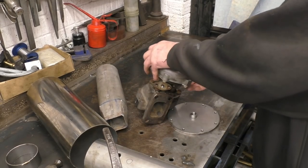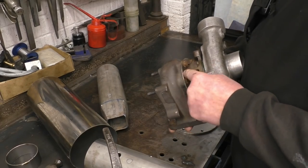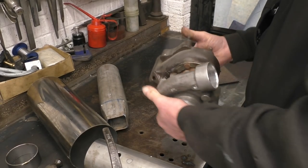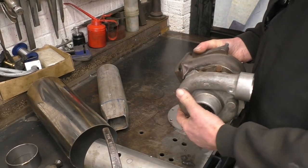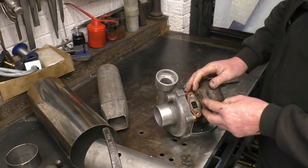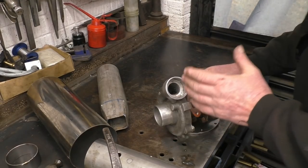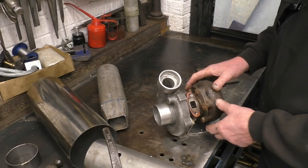The inlet side of the turbo can go anywhere - the exhaust side is fastened to where the studs are actually drilled and tapped. But I want to move it; I want the oil drain at the bottom and I want the combustor can to go in there. So I'm going to try and get these bolts out and see if I can turn it around. It should come apart because it hasn't done a great lot of work as a turbocharger.